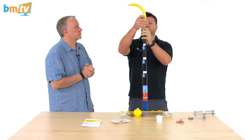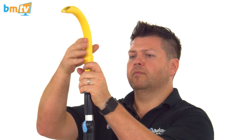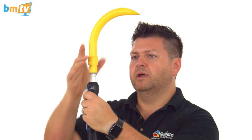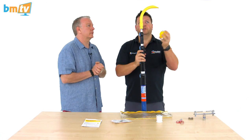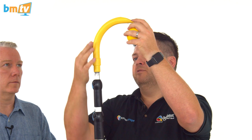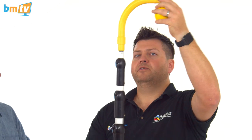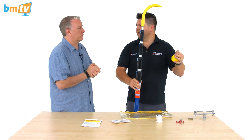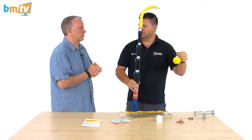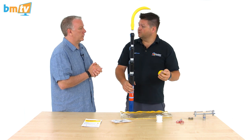So yes, the banana tool just sits and screws directly on top of there. And then it allows you, with the ball tool and the magnet on the end, to attach the loop line — have the loop line run through here, which you manage and secure with your hand — and then you can drop that directly over the top of the RSJ or whatever part of the beam is in the building. Drop that down, attach what you need to on the other end, and then pull it back up and secure it into position.